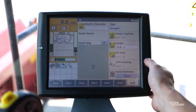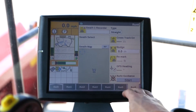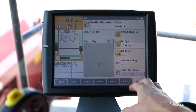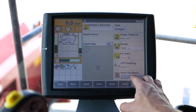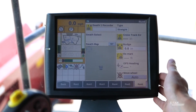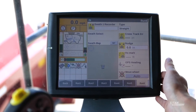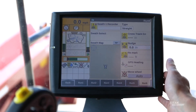The first thing we're going to want to do is navigate on our run pages to the screen dedicated to our auto guidance. This combine is run six. Once we have GPS signal, we're going to come over here and hit our start button and accept the liability warning. Once we do that, the screen is going to tell us to move the wheel, which tells the combine that the steering sensor and valve are fully operational and reading correct voltages.